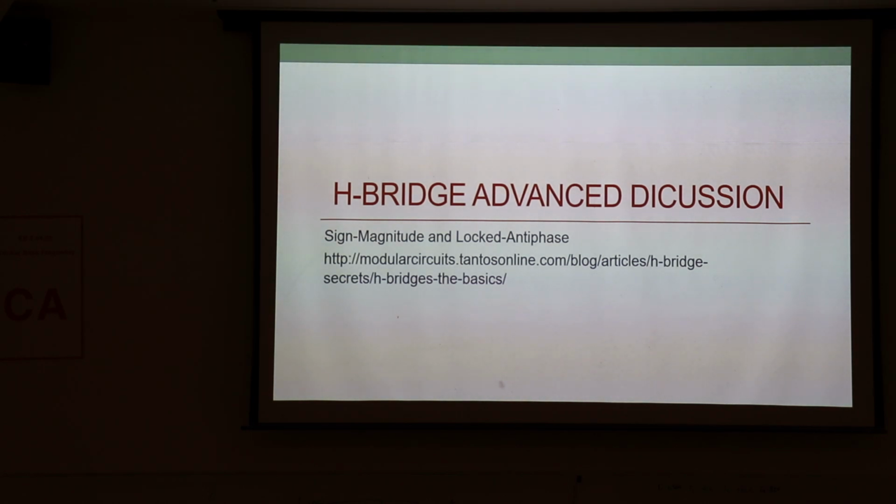Now, if you take a big motor, and you put the positive and the negative in, and you take this to ground, and then over here on the positive, you have a big rheostat, and you change this so that you're dropping less or more voltage across this resistor, then you can change the speed of this motor. But as you change this rheostat, you'll get to the point where you're dropping a lot of current across the resistor and the motor stops running. So you won't be able to run that motor really slowly. Way before you get to that point, it'll just stall, because there won't be enough voltage in its magnetic coils to make it go around.